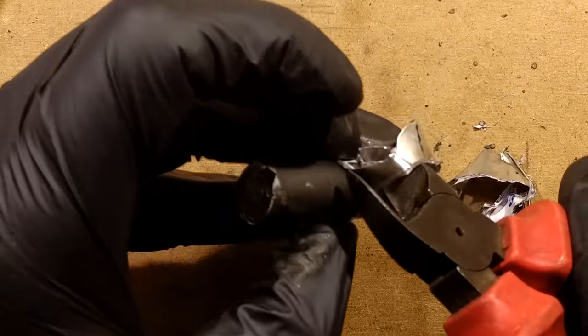A little bit of research says: 'Do not open battery. The negative electrode material may be pyrophoric. Should an individual cell become disassembled, spontaneous combustion of the negative electrode is possible. This is much more likely to happen if the electrode is removed from its metal container. There can be a delay between exposure to air and spontaneous combustion.' While I was taking that cell to bits, little bits of material were actually spontaneously fizzling and combusting. Now at two o'clock in the morning I'm going to have to empty everything off my bench to make sure I find every bit of that material just in case it bursts into flames in the middle of the night. The moral of the story is: don't open nickel metal hydride cells - some of them can burst into flames.